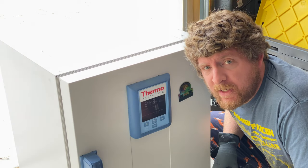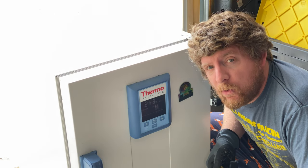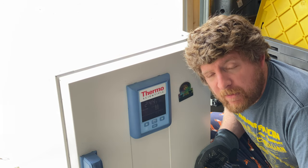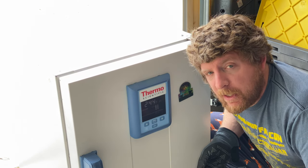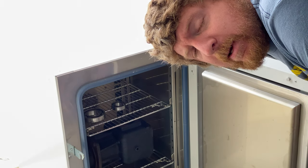It's been about 30 minutes and our oven has pretty much reached temperature. I'm gonna go ahead and check what the components have reached with an infrared thermometer. This is good to not just put it in there and assume everything got to the right temperature. You know, the sensor could be off in here, or your oven or whatever you're using. Looks like the case is about 212 degrees. My test bearing's only at about 150 and the new good bearing's about 160.